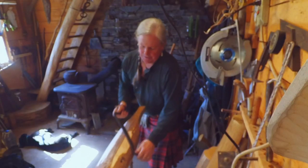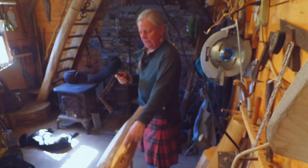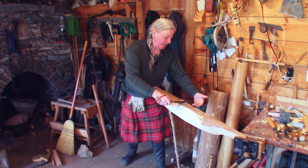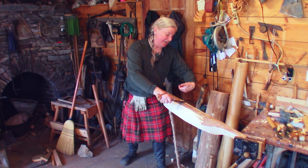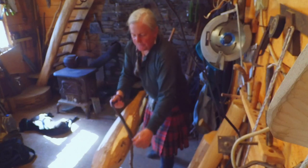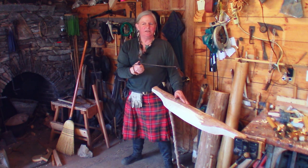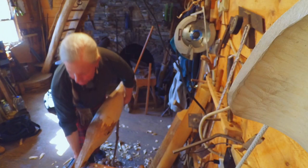See how I'm using it at an angle? Because I've got what they call a cat face, or an old knot covering, the grain is switchy. So if I come at it straight like that, some of it cuts fine, but some of it gets under the grain because it's going in a different direction, and it rips it up and makes a cavity deeper than you want. So if you cut it at a skew like that, it slices it and you can get more control through it all. I'm going to take it out and have a look about.